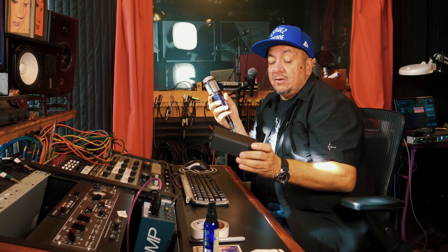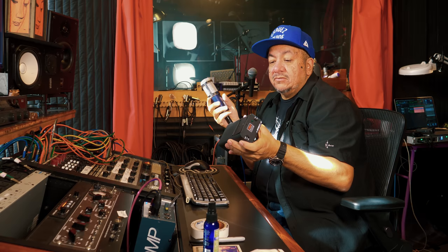I don't have anything else in my recording life — besides using eyes and ears — to verify phase. If you're analog and looking at meters, you'd have to listen to multiple sources to know if it's in or out of phase. But this little speaker tells you immediately. I just did a session with Pete Thomas and had a full drum setup. Vahe came by the night before and walked through my rig with me — and I found that four of my mics are pin three hot and out of phase.